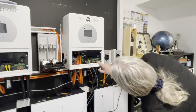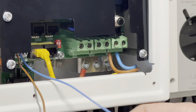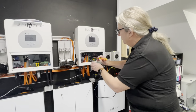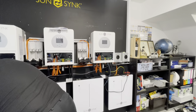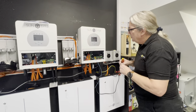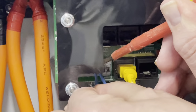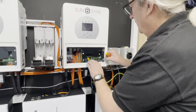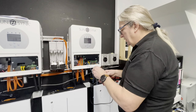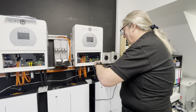You can get these little inline fuses — however it's done, there should be some protection on it. I've got my load here — normally the load would have the UPS socket connected to it. I need a negative power. For the sake of clarity I'll change the colour of that cable to blue. I'm actually choosing to switch on the negative. Give it a little bit of torque to make sure it's connected properly, then I need to make two negative connections onto the grid — one for the earth bond.